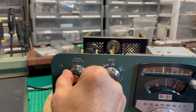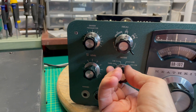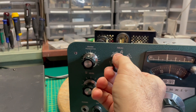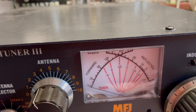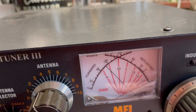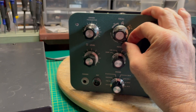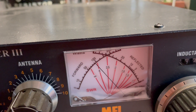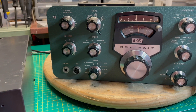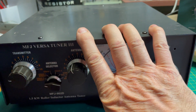Get my peak on the driver pre-selector — same place — then put it in tune. I'm adjusting the final knob. There we go, that's peaked. Now the driver pre-selector — peaked there. And now the thumb switch — there's our peak. We are tuned on 20 meters.